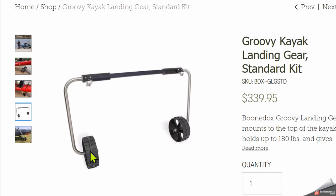In this particular case, we have the plastic wheels, and if you've ever rolled a cart or a dolly across the shop, when it hits a small pebble, it comes to a screeching halt. It just stops. Well, we have something similar here, right? A small rock on these wheels will stop them from rotating, and when that happens, again, all the weight and all the momentum goes into the leg, and you get a bent leg.